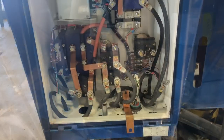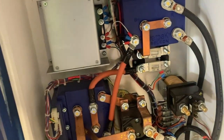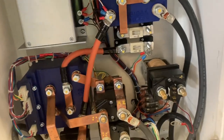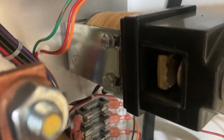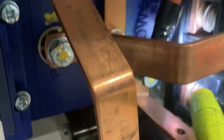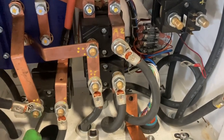Now I'm going to show you a little bit more about annual maintenance on the Zamboni. This is the power distribution box behind the seat of the machine. You've got a main power relay right here with contacts in there — all the stuff is made so you can take it apart and replace the contacts. This one's on and off every time you turn the key. You're going to see some wear — the contacts start to get marked up and worn. Your forward and reverse are these two here. Every few years or so you may want to replace these.